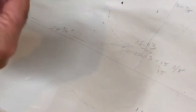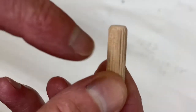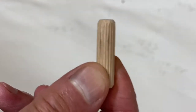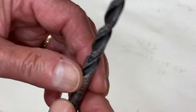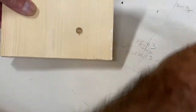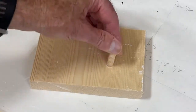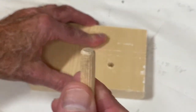In order to replace that peg, you'll have to buy yourself a new one. These are available pretty much at any hardware store like Home Depot, Lowe's, or Menards. You can see it's got some ridges that poke out from the dowel, which helps it fit nice and tightly into the hole. I selected a 3/8" bit — I drilled a hole into a test piece of wood, and when I fit my dowel in there it goes in snugly but I can still get it in.